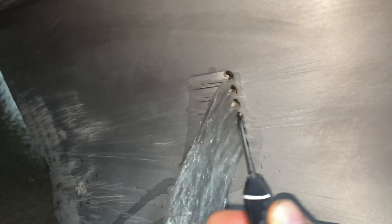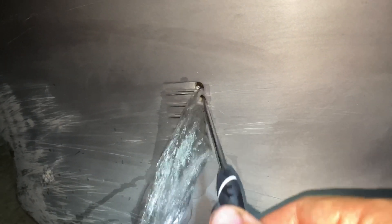There goes the rock. All right, you can see here we have a pretty steady stream now. Let's see if there's anything else in there. Here's another little rock — got it. This is why I say you need to take your time when you're doing this, because you may find more little rocks in there that could go back into the impeller and even after you fix it you could destroy it again. So definitely let it run a little bit.